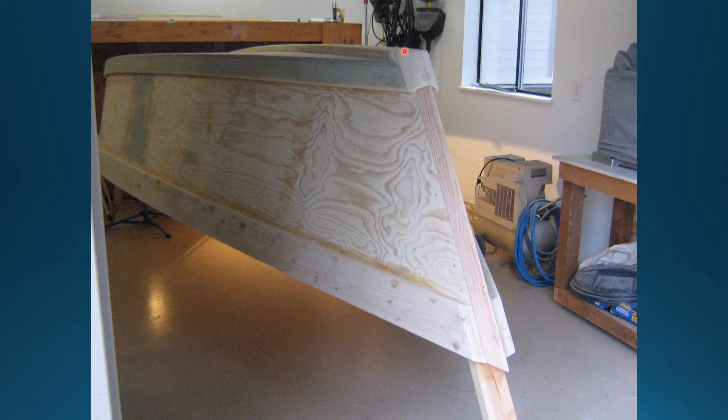This junction right here is critical. The ends of the chine logs come together here, the keel ends here, and the inner stem that the side panels are fastened to ends right up here underneath the bottom panel. The bottom and side panels also end there — they all meet at this point. Most of them are exposing their end grain straight at the oncoming weather, so they must be protected. That is what this bulbous non-structural block is trying to do: protect all the end grain of all that structure.